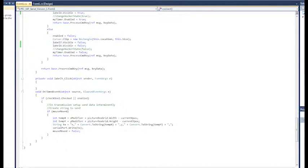Once I've got that, my PIC is basically using comma delimiting. So I send it the command, which is X, the X axis, and then a comma, so it knows it's the end of the command. And then I convert that raw position into a position my controller can understand. The way I did that was kind of tricky. I took the X and Y modifiers as the minimum value on both axes. So at the minimum value, if I add 0, I'm at that minimum amount of travel. And then if I add the full width, or the inverted full width, if you want to get technical, of my picture's width, it would be 1500 plus the minimum, and that would be my total range of stroke.